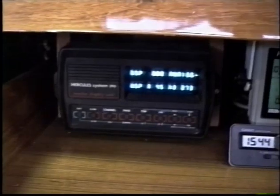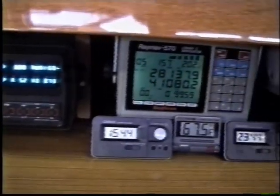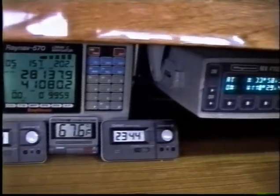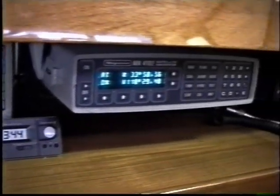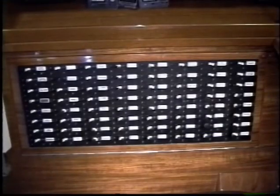Electronics are installed so they're handy to use and can be quickly removed for service. They have extra long wire harnesses, allowing easy access for repairs. With this approach, you can update gear without having to find a carpenter. There are dual pole circuit breakers for each piece of gear aboard. The panel looks complicated, but it's actually quite easy to use and greatly simplifies maintenance.